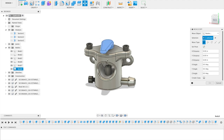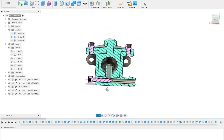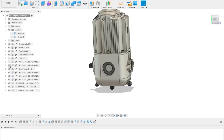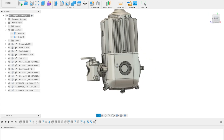I can also adjust the air rate using this little handle here — you can see I can rotate that handle to open and close the carburetor. So in conjunction with this handle and the needle screw down here, I'm able to finely tune the air-to-fuel ratio and hopefully get the engine running. When this is attached to the engine it looks like this, and it's held on with two screws on either side which also help hold the two halves of the crankcase together.